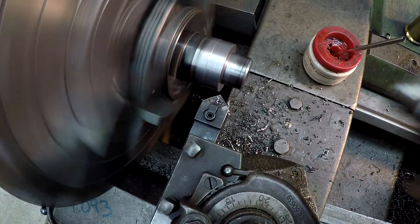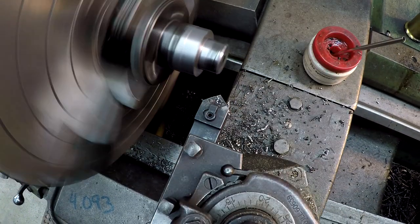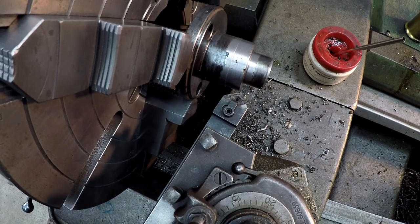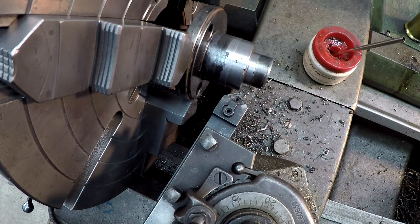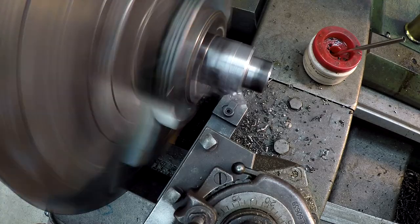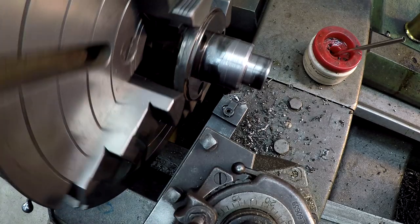We are going to put a chamfer. You can see on this one it's got a nice lead in. Matter of fact, here's one of the beauties with the multi-fix. You can kick it around 9 degrees if you want to change your angle a little bit. So I'm just kind of eyeballing that angle. And you see that set back a little bit so that maybe a lip seal can go over it. Kind of cleaned up the weld there too.